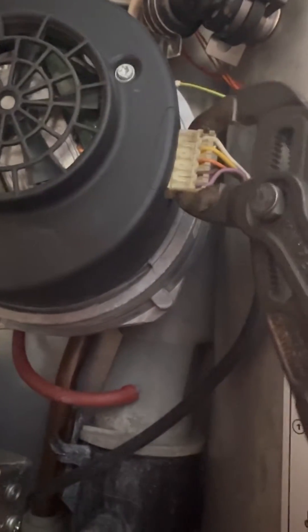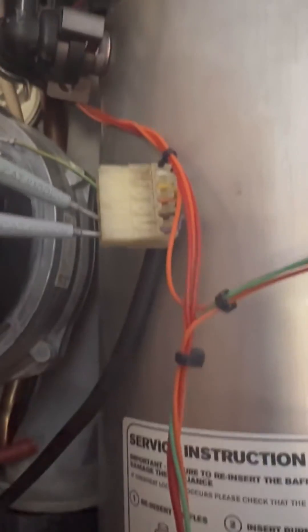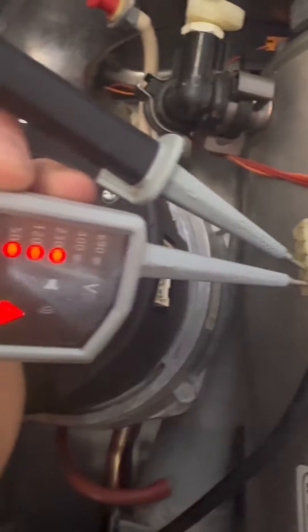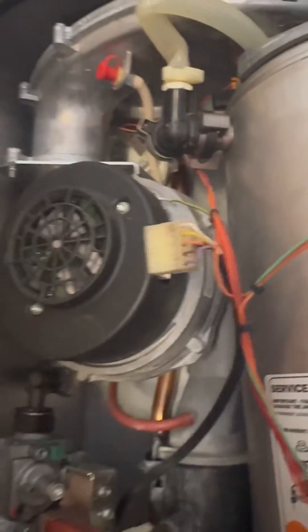Fast flash is normally the fan, so we're going to whip the case off. Going to use a pair of grips to remove the block off the fan — using grips saves pulling on the cable and it can be quite awkward to get out. So we're going to be looking at brown and purple, get our voltage tester and pop it in brown and purple to see if we're getting 240 volts. We are — so it's the fan at fault.